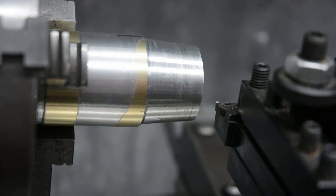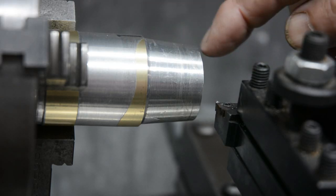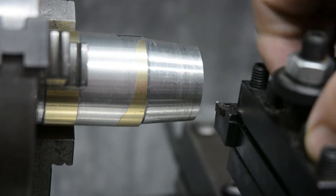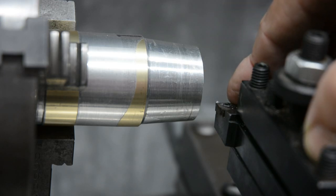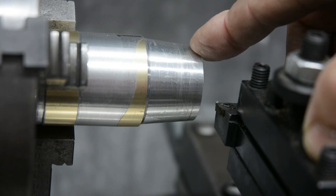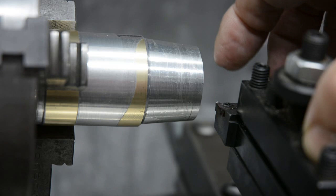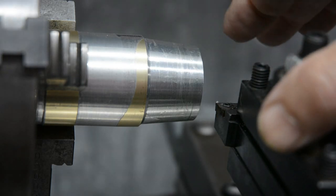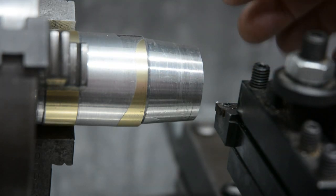This is a first test of screw cutting on a taper. I've previously cut a 1-in-10 taper. I've set the control to do a 1 millimeter pitch thread with 0.61 millimeter total depth of cut, four passes, and the speed is a bit over 1000 RPM. I haven't tested this at all before, so I've got my fingers crossed - let's go.